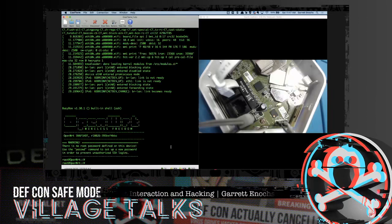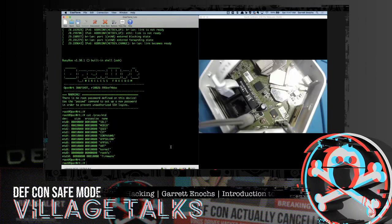It's not the direct file system on the Luma, but we can still do things similar to the Hue, where we can dig into the root file system. We can look at the kernel, the firmware. There's a lot of things that we can potentially get into. There are several different techniques to do that. One of them would be mounting these drives. Assuming that we had full permission, we would just mount these drives and start extracting data from there.